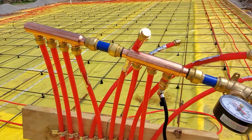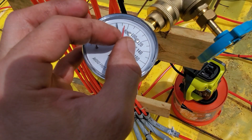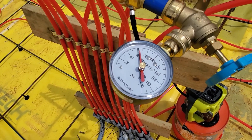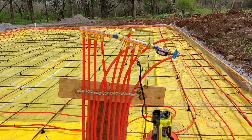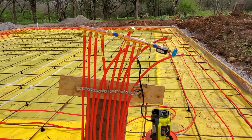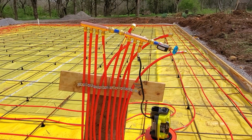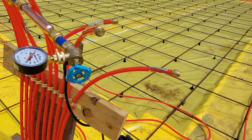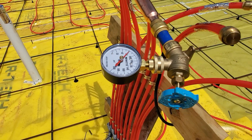I've got everything set up here and I've got my 60 pounds of pressure. This little gauge is supposed to keep it in line. Now I've got 60 pounds. So what you do is you leave the air pressure in there and then check it again tomorrow — make sure it hasn't gone down at all. It may go down as the day cools because right now it's about 75. As the day cools the pressure's gonna go down a little bit, but as long as I haven't lost probably more than five to ten pounds of pressure I'm good to go. So as long as it doesn't get down to 50 we'll be fine to pour tomorrow.